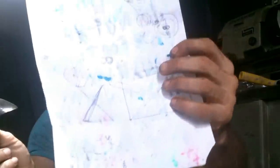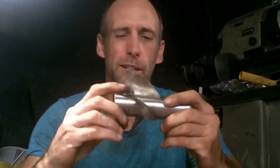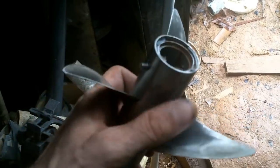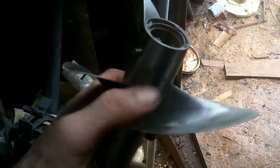This should be a pretty optimized propeller for the boat. Before making this one I also did some calculations to check that my propeller blades are at least theoretically about right — and they seem pretty good. I did increase the pitch just a little bit based on those calculations, because my old propeller was apparently limiting my speed at about nine miles per hour, and I got up to 8.9 miles per hour. So I made this one to hopefully go more like ten. I've used up all my curved pipe, so hopefully I got it right. Look at that — so smooth! I did have to buff the inside because that was an exhaust pipe, so the outer curve was very shiny and polished but the inside was pretty rough.